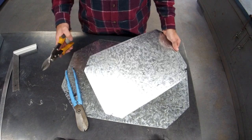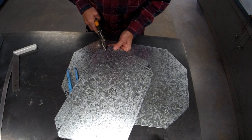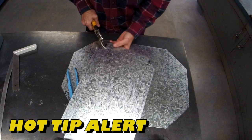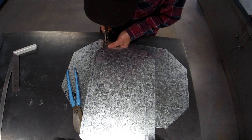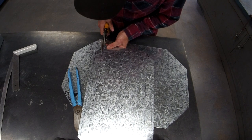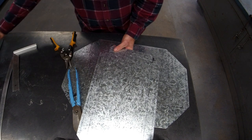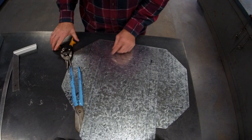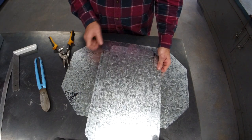So, my only hot tip with the tin snips is, please make sure you're cutting out what you need. And it's really important that the tip goes right into the corner. With all of sheet metal work, we need really clean corners, so be real fussy with that bit. It's got to be super clean there. I'm not allowed to have it a little bit short or a little bit daggy. I'm not allowed to have a little blob there. So it's got to be nice and accurate. So be fussy with that part.